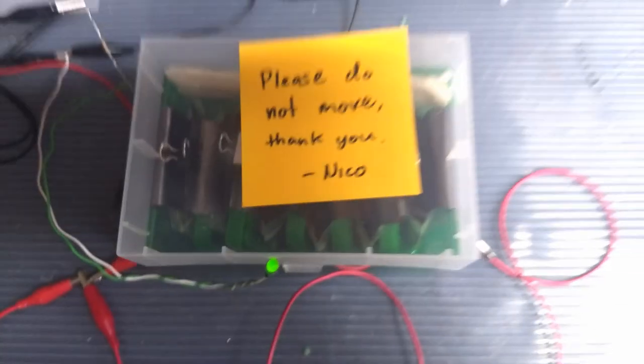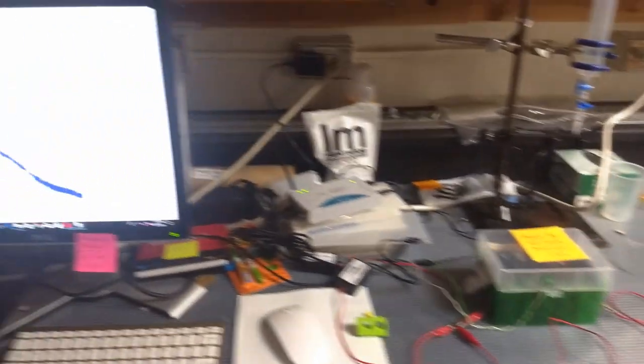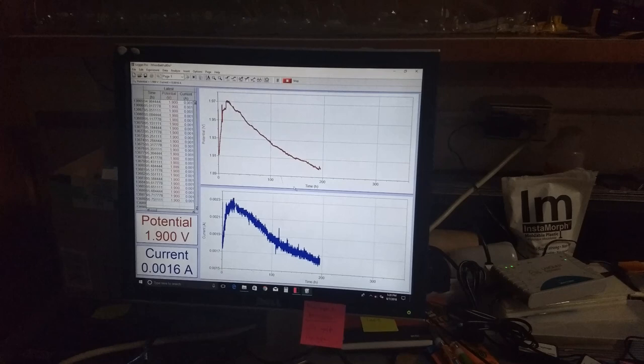Things have been going slowly, but for a good reason. This week we have been waiting for the battery to fully discharge so that we have a number to quote for the capacity of that battery in terms of watt hours. It's been discharging through a little green LED now for several days. It remains strong. You can see here on the graph that it looks like it's changing dramatically, but that's just a scaling — just the change from 1.97 to 1.94 volts or thereabout. So it's only a few percent change in the voltage, which means it still has quite a ways to go. It's not linear voltage to capacity, but it still means that scale is not indicative of a dramatic change. It's actually pretty subtle.